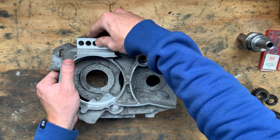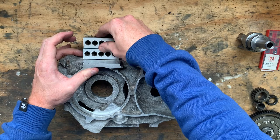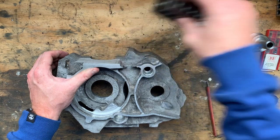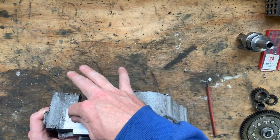The next step was to machine a flat surface on the X-plane so I could set up the part with a high degree of repeatability. I used the metric 1-2-3 blocks to set the top cylinder base parallel to the table in the X direction. From there I used my 12 millimeter end mill to remove the minimum amount of material to create a flat surface.